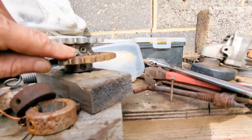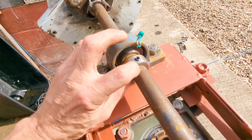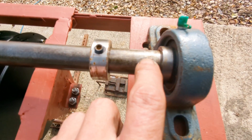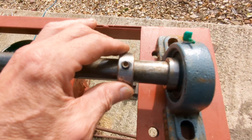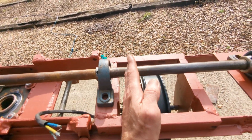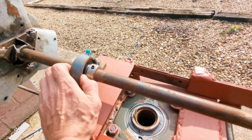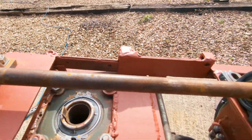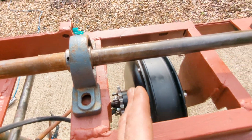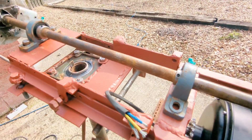Which would mean it'll have to be done up by that grub screw. Just a reminder there are bits still to do on the drive shaft — for example there'll be one collar here and a collar on the back. I know I've said before, but we'll need to drill a hole here for the grub screw — I'll probably get rid of that and use an actual bolt — so there'll be a hole there and a hole there and that'll be bolted in. The important thing that does is that when we get everything perfectly aligned it can't slide back and forwards. I've had it before where the turbine is going up on the tower and it flops around and because I didn't have a rear collar it just shuffled forward even a centimeter, and of course that takes the chain out of alignment. The whole point is to have it 90 degrees bang on, perfectly in the middle, bolted down.